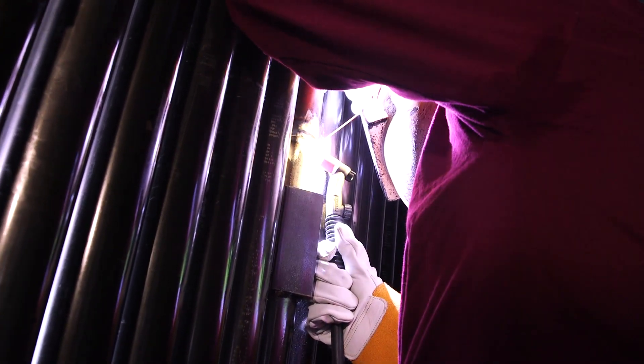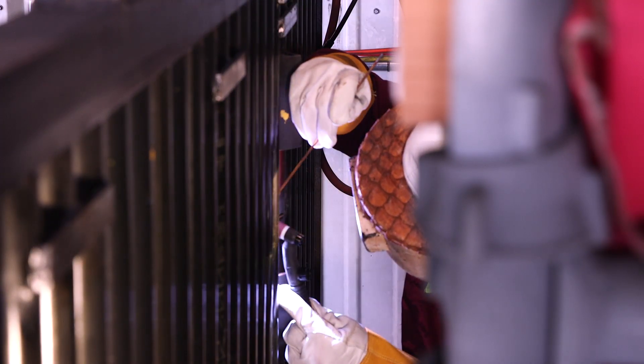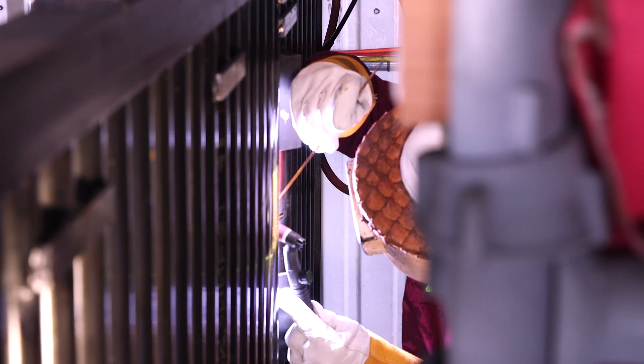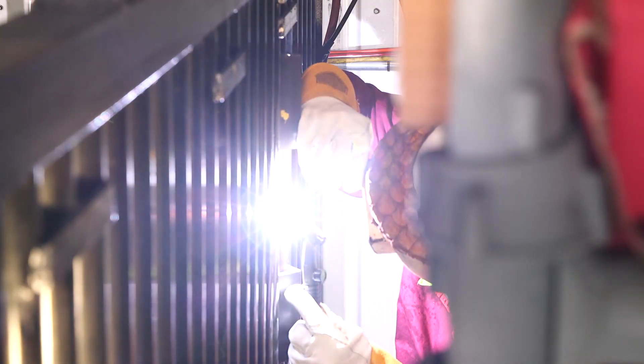Look at the technique he's using to get right on the side of the pipe — this is the hardest part of the weld because he's got the other pipe in the way. He locates his rod on the top toe of the bevel. You want to build up as much as you can in that root fill — fill it up in one pass. Running at about 120–125 amps with one-eighth wire. I'm building up metal on my left side so my partner can catch it on his side, making it as easy as possible for him. Once I get to the center where I last tied off, I like to go back over it to build up more metal so the cap comes out nicer.